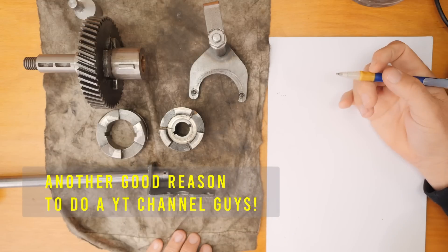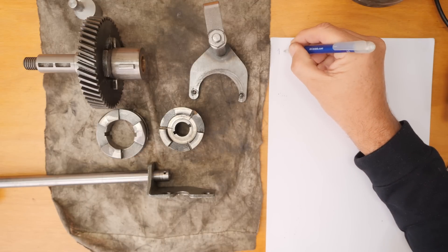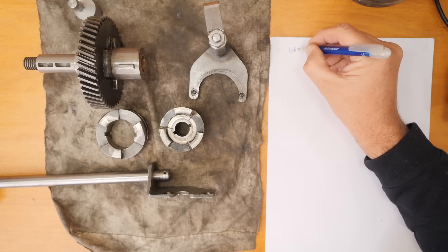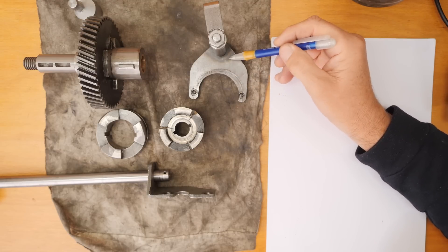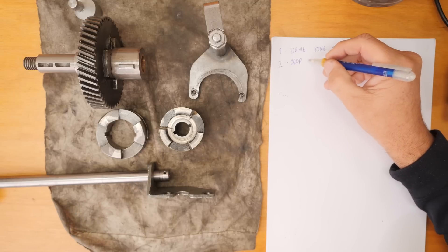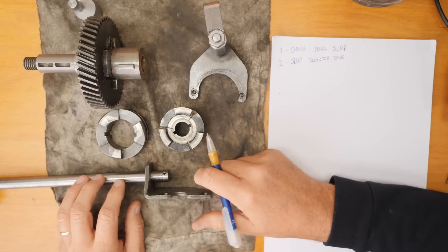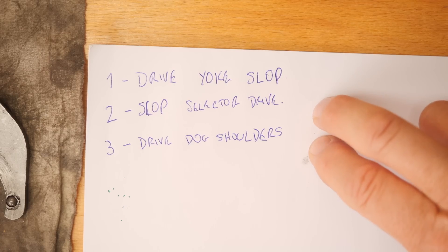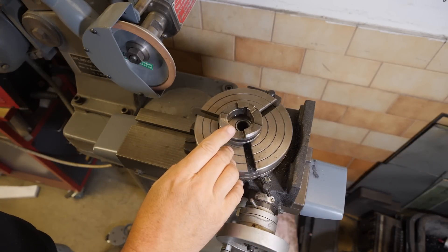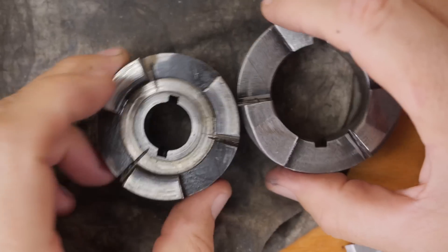It's only really in the edit that I've come to realize I'm dealing with a completely different problem than I expected. Rather than the shoulders being the number one issue, I think number one I need to address this wear and slop in the drive fork - both the balls, and maybe also look at this wear here and consider remaking it. Number two is looking at the slop in the selector arm, both here and outboard on the machine. A third issue is to straighten up those shoulders on the drive dogs. I'm glad I now have a plan of attack - I'd appreciate your feedback on what you would do and whether there's anything I haven't thought of. Thanks for watching. I'm now a little bit more confident of having a hopeful solution and let's hope we get this saw back working properly.